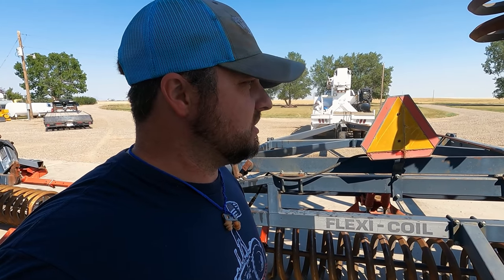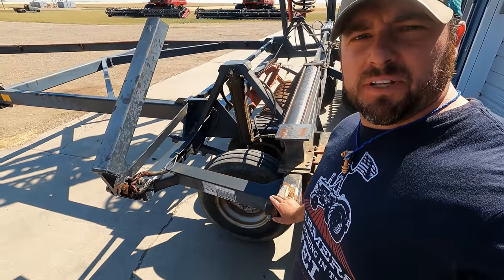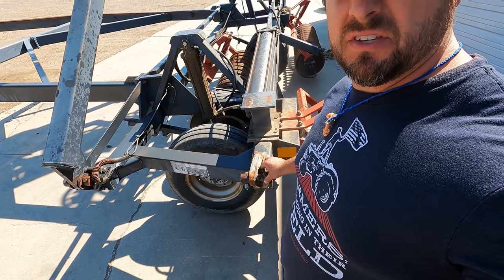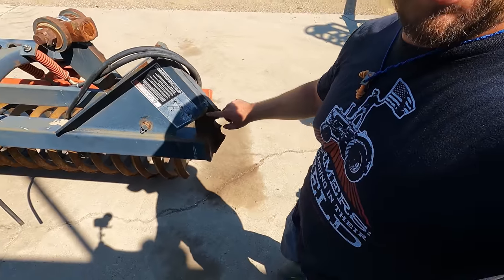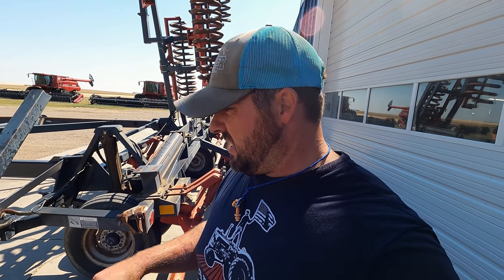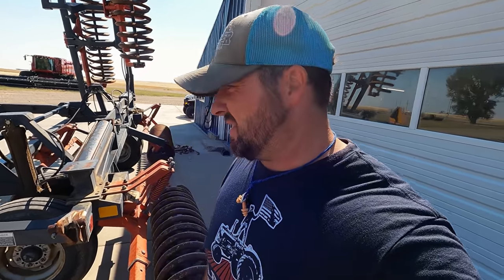But yeah, we should get this thing back and rolling, and should be good. This ripped off last time, it broke apart, and I put a really heavy piece on it and beefed it up. Well, this ear is bent, so I'm just gonna take the torch, heat that up. And then I gotta cut this one, completely cut this all out, because it's all ripped out and broke. And then I'm gonna grab a new piece and trace it out, drill some holes in it, V it, and weld the snot out of it.